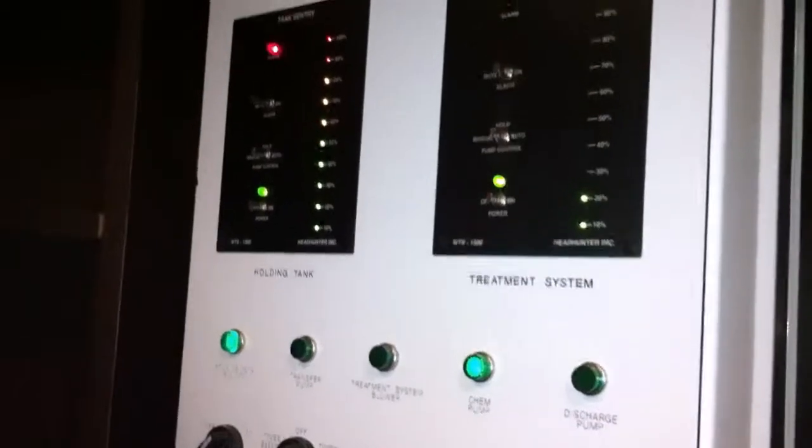Turn the alarm off. Sorry. So I'm turning the screw just till it touches 100%. Now I'm going to go back and I'm going to give it an extra quarter turn in that same direction just to make sure we have a good solid 100% reading. So there we go, that's adjusted. Okay, I just set the 0 and now I just set the 100%. So this screen is fully calibrated now. So now all we have to do is plug the tube from the holding tank back into the sender, press the reset button on the sender, and we should have a proper reading.